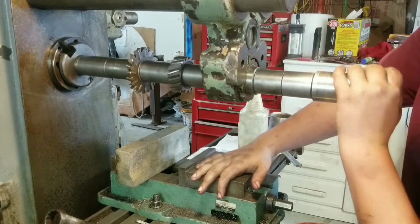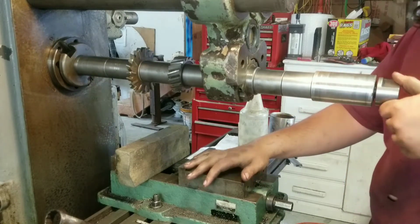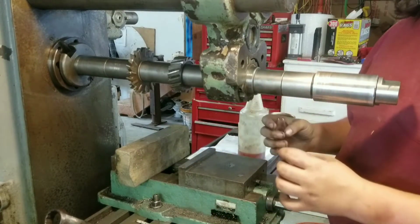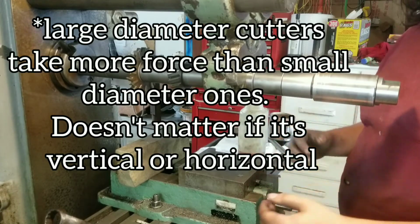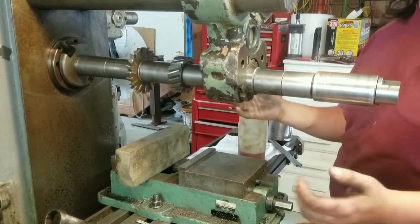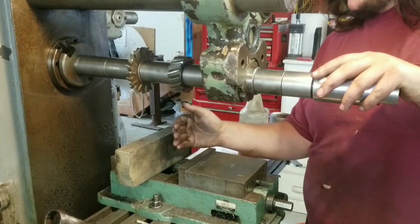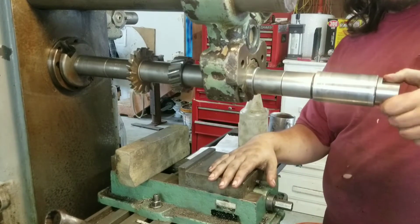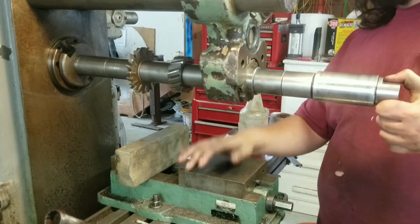I'm going to be putting the workpiece in this vise. A vise in this direction is not the strongest way to hold a workpiece for horizontal milling. All of the forces, and there's a tremendous amount of force when you're milling horizontally, much more than when you are milling vertically, are in this axis, the same axis as the cutters. Kind of obvious. Because of this, there's nothing but friction stopping this workpiece from sliding out. I'm going to have to be quite careful and make sure I'm not taking super heavy cuts, and make sure that this workpiece doesn't go flying.